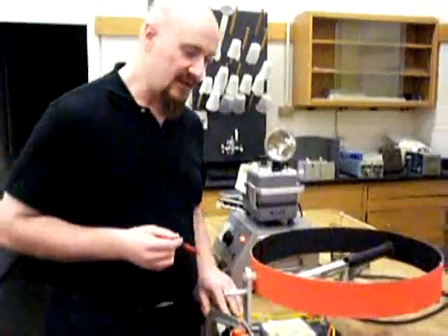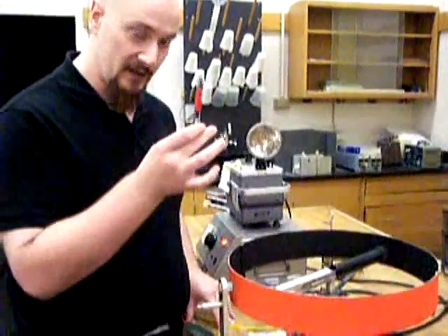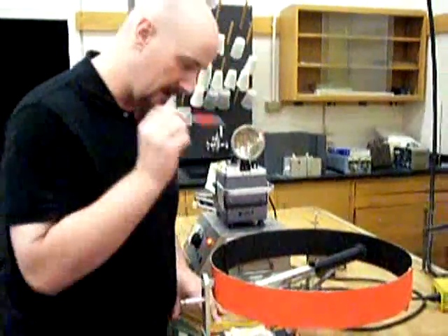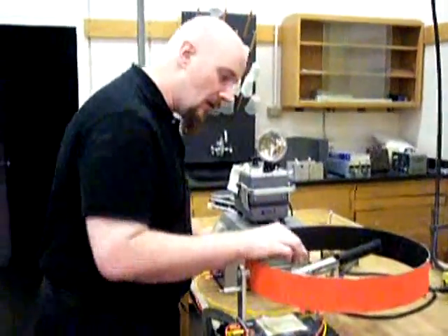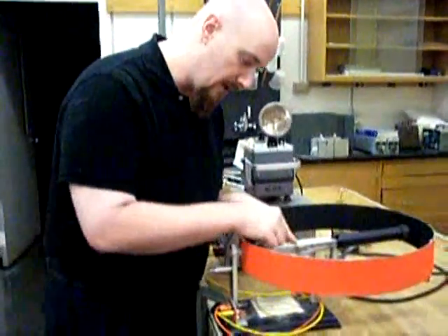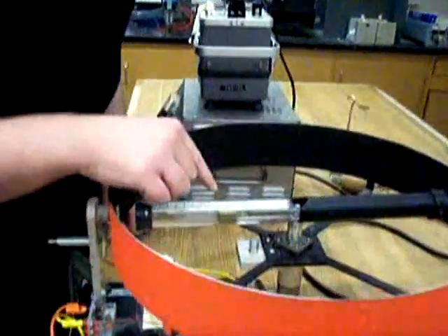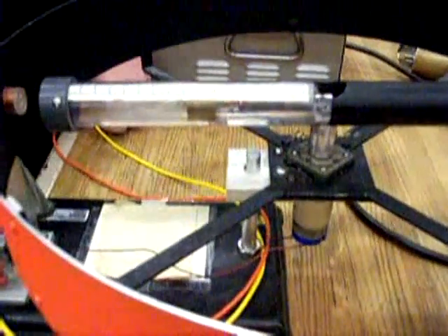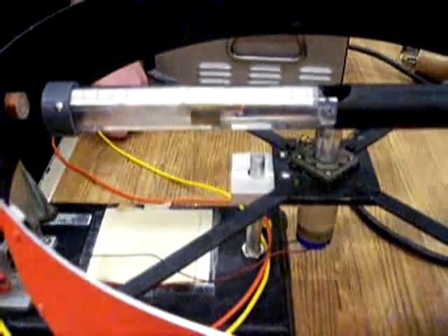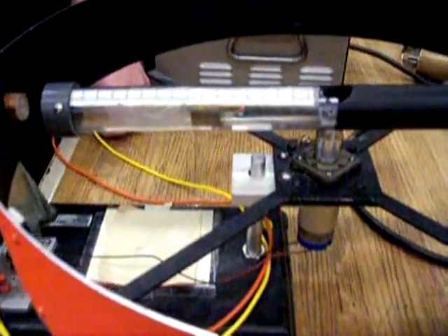A safety consideration: try not to use a pen when you're measuring your elongations — you could get a little too close and catch it on the spinning wheel. We want to measure our elongations with the center of the brass cylinder. Match it up to the ruler that's conveniently taped on for you, and try to get it to two decimal places — do your best.